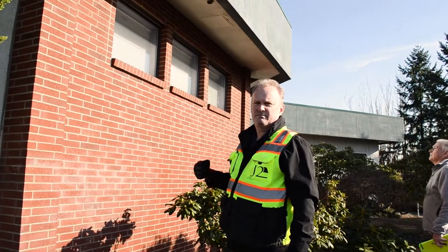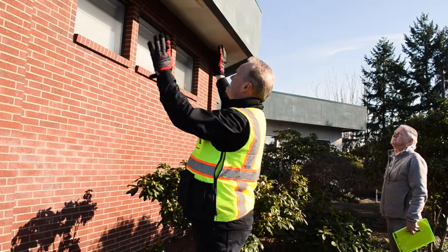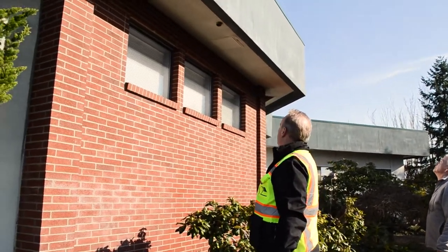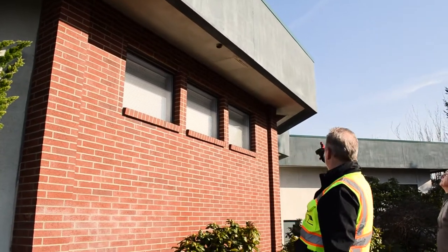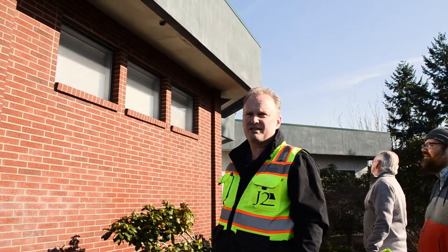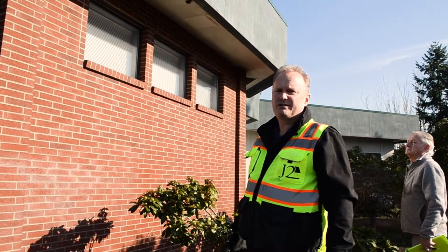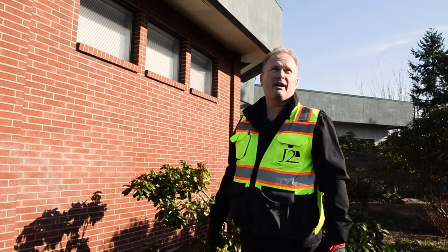The white efflorescence is salt — it's evidence of water coming through the cement and bleeding the salt out, creating white staining. If you see white drip marks or white staining going all the way around, that's an indication you have a lot of water going through the system. It's not necessarily evidence of water damage, but it means water is coming through and you need to follow up.